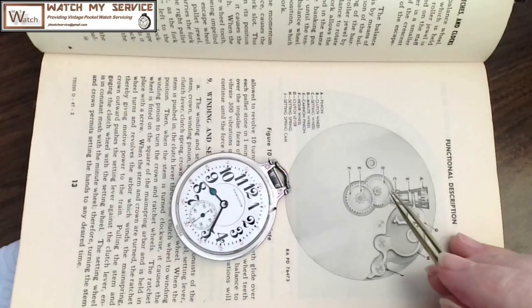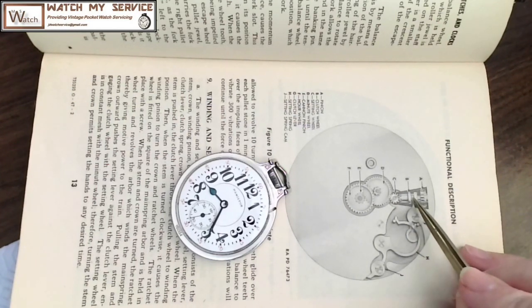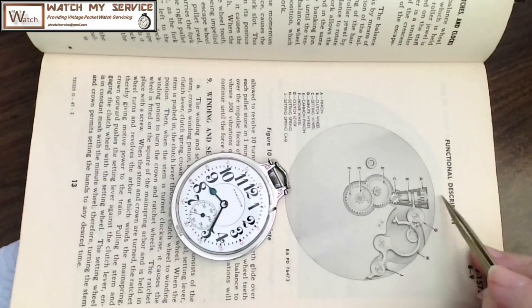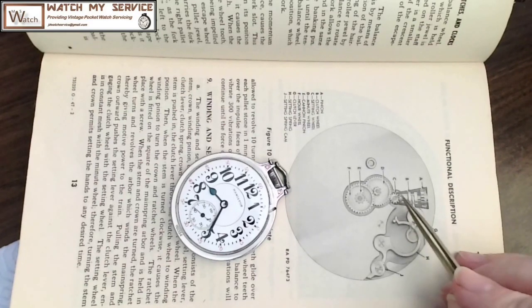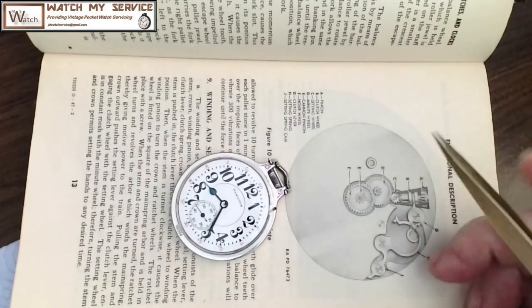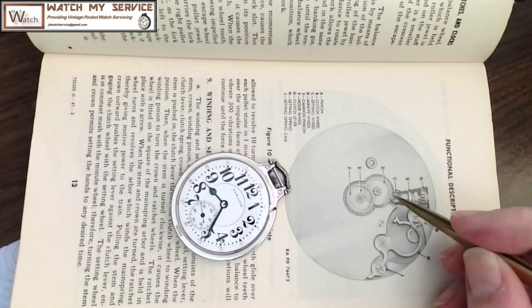But if you've got screws that are loose at all, like if this screw is loose here and this comes out, then the clutch wheel won't move forward. When you pull the stem out, this doesn't move forward, and that could cause it not to catch properly, and you might feel a little bit of grinding going on. If there is grinding going on, don't force the parts,